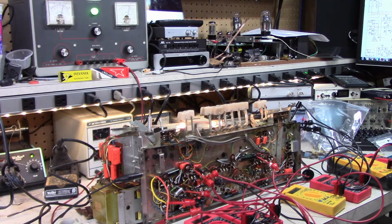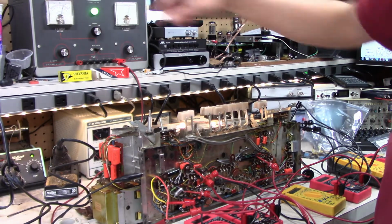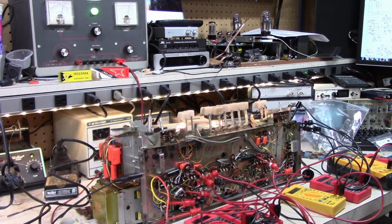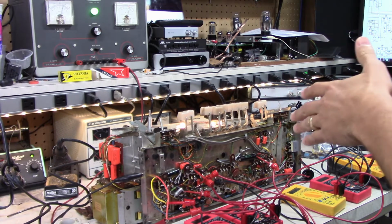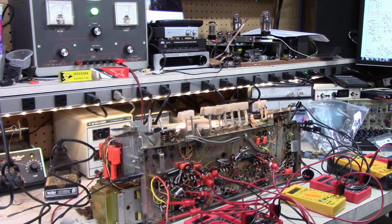So yeah, successful test. It's powered up. There's no power supply yet, but it's drawing 100 milliamps. I'm pushing the power supply here to its limit, pretty much. That's good to know, so I can actually test this more without having to build a supply. Though I still need to do that, but it's so much easier to bring it up nice and slow when you're trying to test it out.